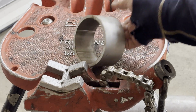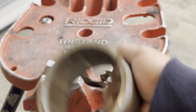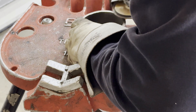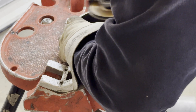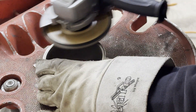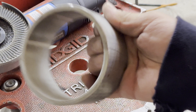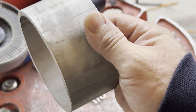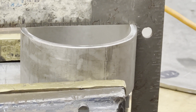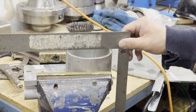Let's take a look at it. The surface is rough, so I will make it nice and smooth with a sanding disc. There is another reason why I left the line when cutting — after this sanding, the pipe length is almost bang on. All the work is done and it looks okay. I put it on the bench vise and use a square to confirm if the pipe is straight — and it is pretty straight.